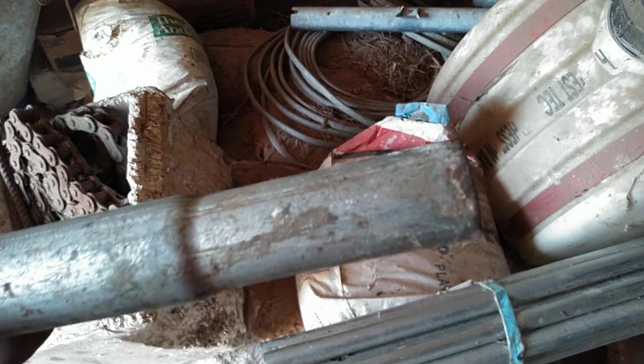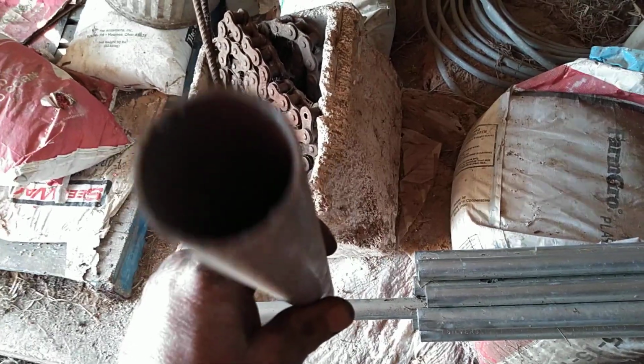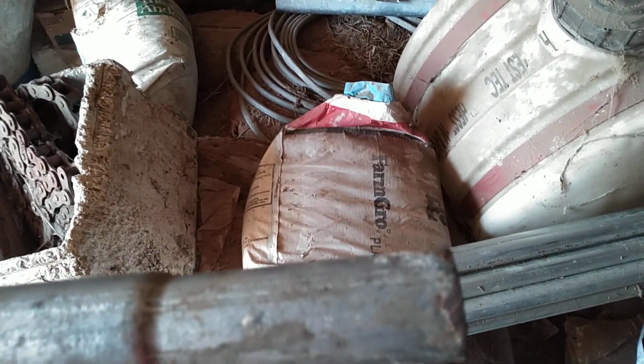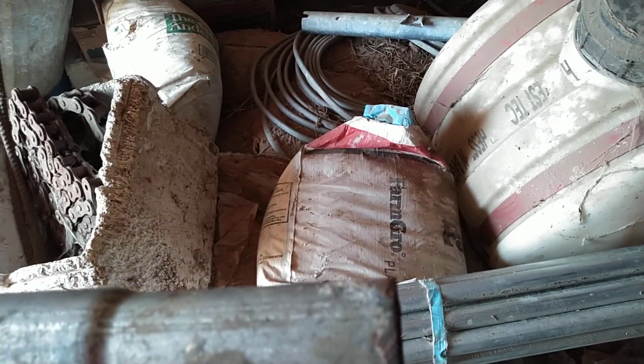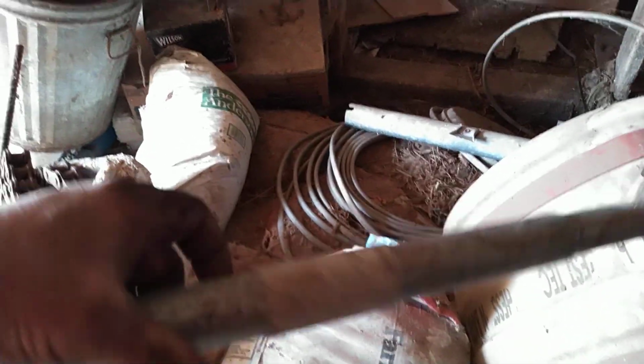And what they did is they swedged down this end, so you just slip it into this end here on the next pipe to go through. And then they took them self-tapping screws and drilled through to connect them, and then they wrapped the joint with duct tape so that them screws wouldn't wear through the curtain. And then they say you got these aluminum clips that go around the outside of the curtain and snap onto that sleeve, and that's what holds it, so when you start rolling the curtain, it rolls it up. Well, like I said before here, these clips ain't gonna fit on there.